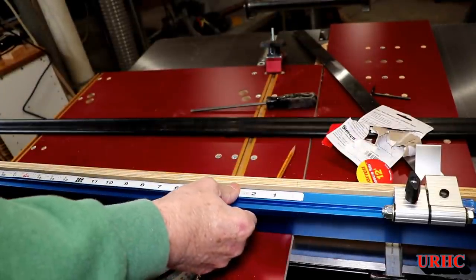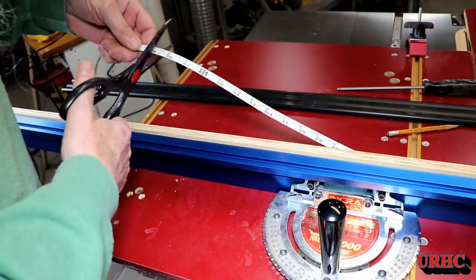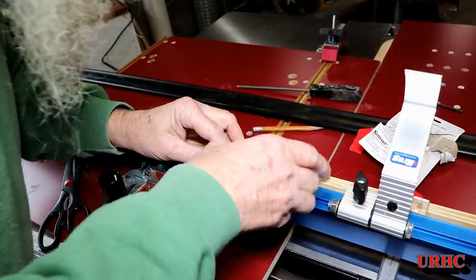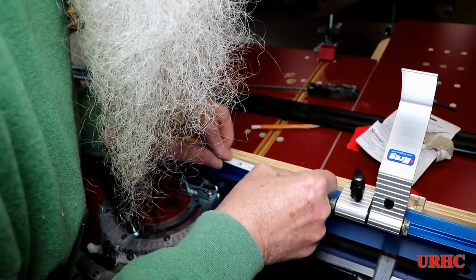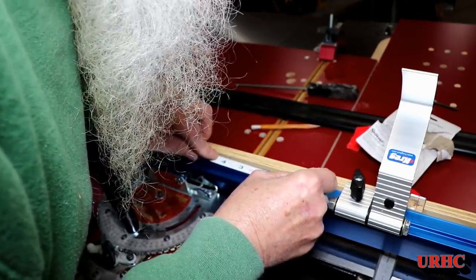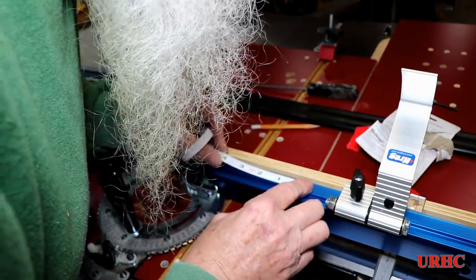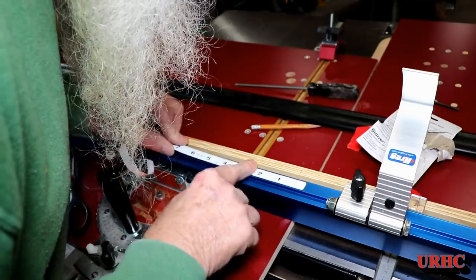It's a really nice metal tape that goes on there with a self-adhesive backing. All I had to do was mark a zero point and get it started at that zero point. I needed 39 inches of it — it cuts with scissors pretty easy even though it's metal. The rest is waste unless I can figure out something else to do with it. The one thing you want to do is make sure you get this started straight with the track because you can't twist it or move it later. You want it centered in that half-inch groove, and it just fits in there perfectly.